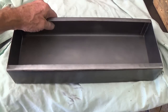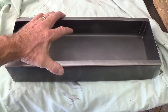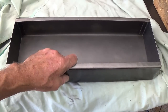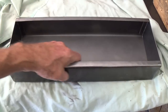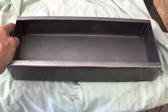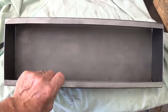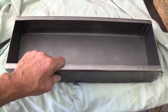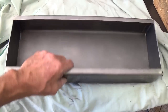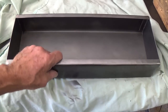That's about it for this chapter on Stone Age chassis fabrication. I hope you enjoyed it. A couple of pointers: I would never use 16 gauge again — it's a little too thick and hard to work with; you're probably better off with 18 gauge. Secondly, if you ask at a sheet metal place, they might do the brakes and bends for you. You could also buy the chassis pre-made from someone like Weber or another company. But for the brave of heart, as you can see, you can make a really nice stout heavyweight chassis in your garage or workshop with a sledgehammer and some 2x4s.